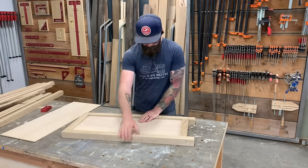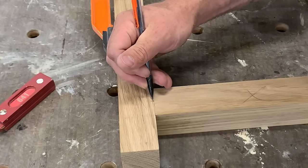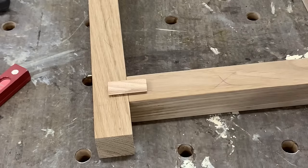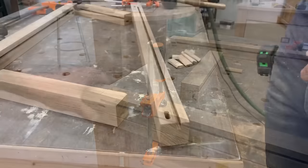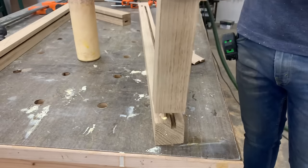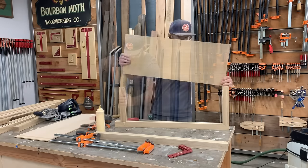To join this entire piece I'm using the Festool Domino joiner — but if you don't have one, don't fret. Use a doweling jig; it's just a sixty-dollar version of the Domino that you can do by hand. I'll put a link to a doweling jig in the video description. I use the Domino joiner to mortise out all the holes for the corresponding dominoes, then hook three of the side pieces together, leaving one side open so I can slip in the quarter-inch panel.